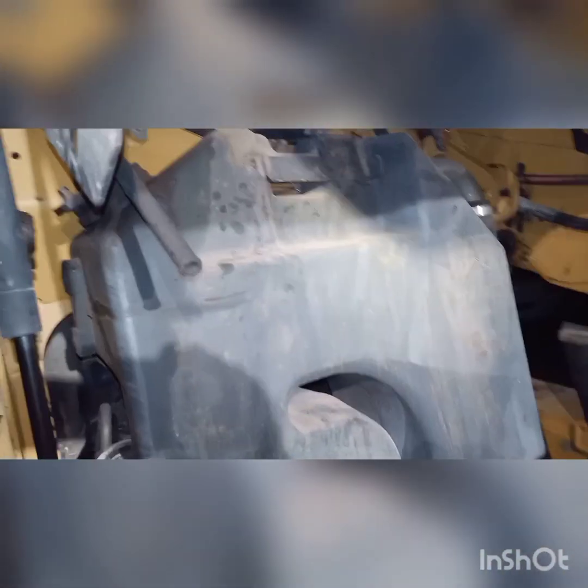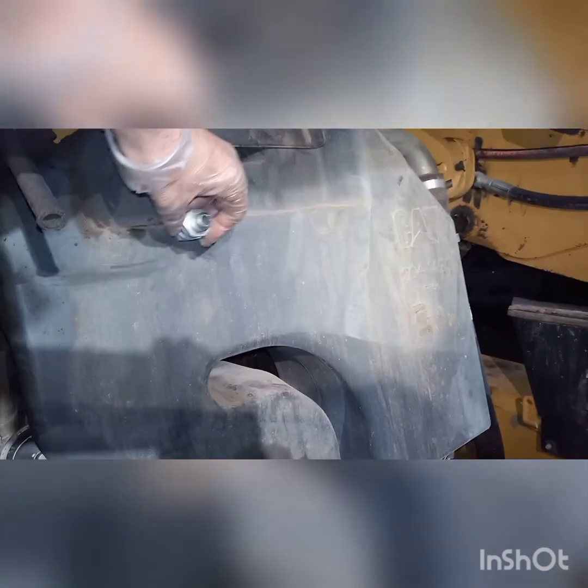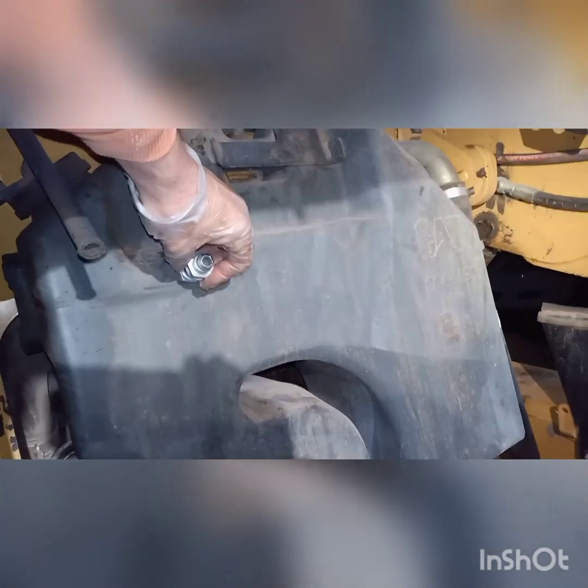We'll take a measurement from the other side because you don't want it up high — you don't want aeration in your reservoir. The fluid level is roughly here right now, so we're going to install the fitting somewhere around that level but on the other side, because I'm going to have to reach through to put the nut and washer on the back side.